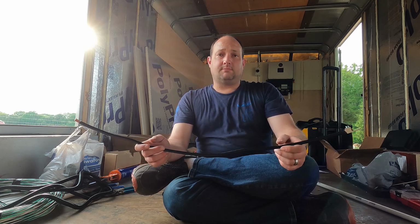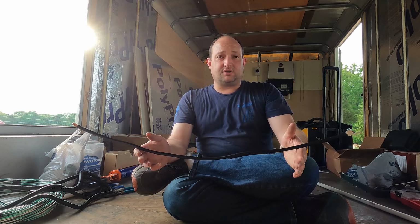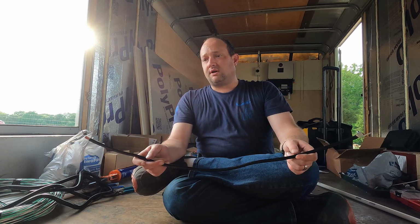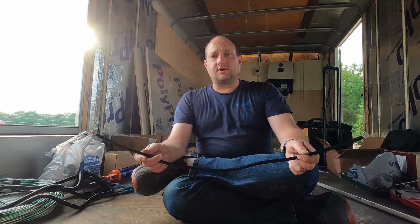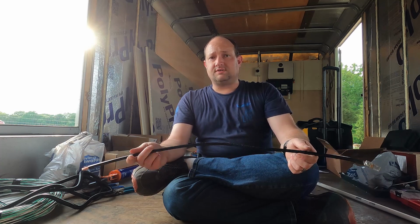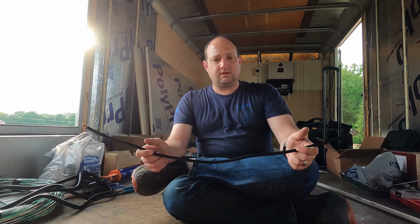I can't help you. I said, well, what about 2 gauge? Let's go the next size up. There's a problem with being too small when you're dealing with electricity and current flowing through wires. There's not really a problem with being too big, other than it costs you extra. So he spun the reel around and said, oh yeah, I got some of this. How much do you need? I said I measured about 30 inches for 4 connections, so about 120 inches is what I need. He rolled it out in one piece and cut it off for me.